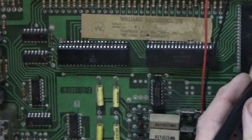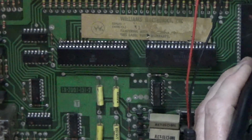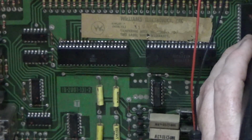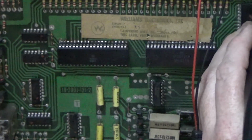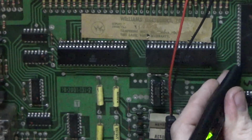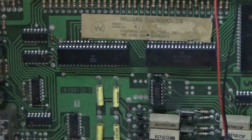Okay, now the switch one, you can't check the bottom half of this switch matrix one. You had to ground these pins to do it. They'll just test as low if you don't. 5, 6, 7, 8, 9. But the top half you can. 10, 11, 12, 13, 14, 15, 16, 17, 19 with the weird thing again, but that's just how it is, I think. And finally, 39. Okay. Seems to me like it's that one, pin 5 is our problem. We still might have this, but you had to hook up a ground or something to it.